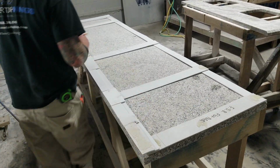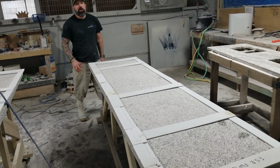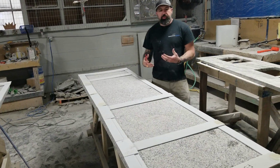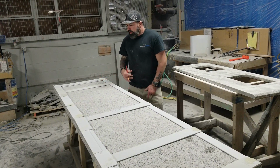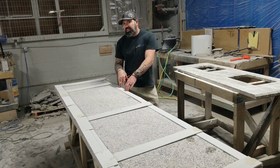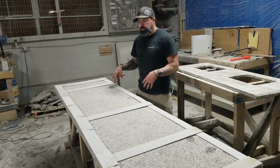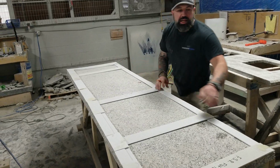What I noticed when I was lining that template up is it was not lining up perfectly. What you'll have sometimes is your other guys, when they flip it and so on, they'll get the template direction mixed up. And then when they go to cut a hole, polish, drill something, they won't double check the template. And then it don't match up and everything's backwards. So that's what happened right there.